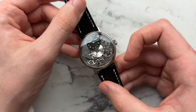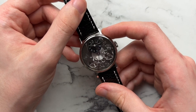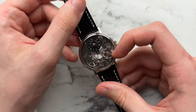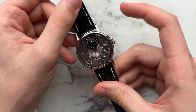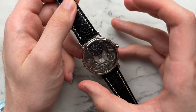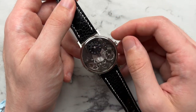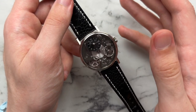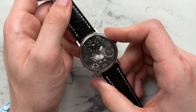Zooming in on the rest of the dial — this is where most of the movement and gears are, and it's honestly the main attraction of the watch. On display you have the great wheel, third wheel, fourth wheel, and escapement, plus the balance wheel. They're very symmetrically laid out with individual finger bridges for each wheel, which is also a callback to vintage Breguet pocket watches. The base plate and bridges appear to be frosted and blasted, giving a subtle sparkle sheen that's not traditional striping — it's a very subtle, almost utilitarian look.